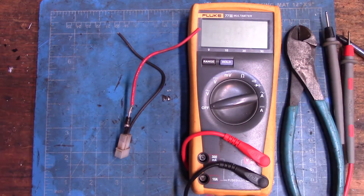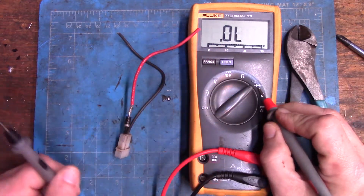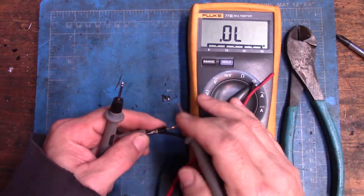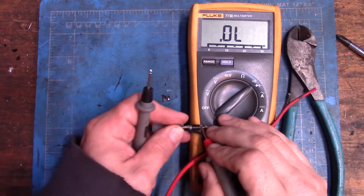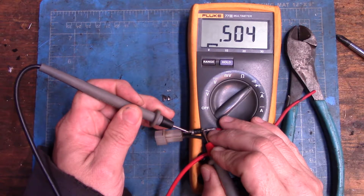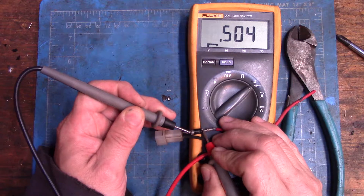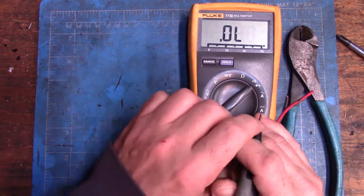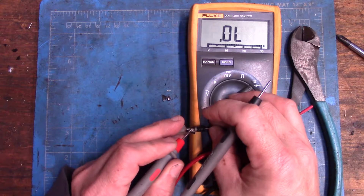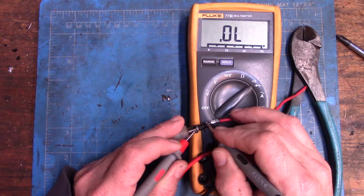Let's give it a quick measurement. It's very easy with a multimeter that has a diode setting — this setting right here, a little arrow and plus sign. Put your positive lead on one side and your negative lead on the other, and we're getting 0.5 of a volt through there. That is normal for this type of diode. Then we'll reverse it — put the negative lead on the other side and the positive lead on the opposite side — and we should get an open circuit, nothing there.